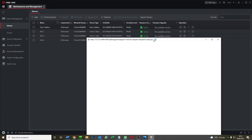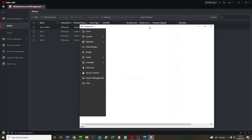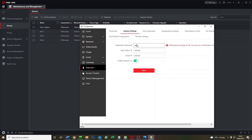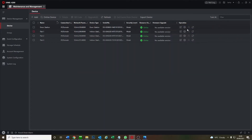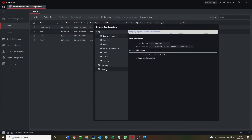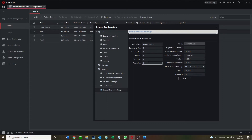We start by going to the door station. We've done this setup before in previous videos; we've just added the keypad so it's pretty straightforward. Go to session settings, put in your password as usual — that's the door station set up. Then go to flat one, go to network group settings. Room number here basically means flat number, so that's already set to number one. Put in your password and the IP address of the door station, which you can get from the list above, then save.